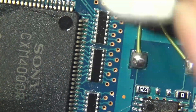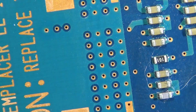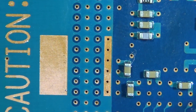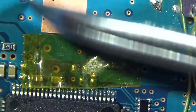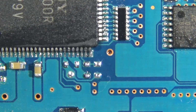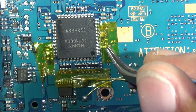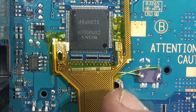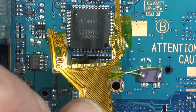It's all good. So this is my first one here. And I was just going by the books from the guide. And I believe we're going to be seeing some Kapton tape here, which I don't recommend. I recommend doing UV resin or solder mask. So just like this, we capped the vias below the resistors and all of the pads that are below the flex cable on those sides there.